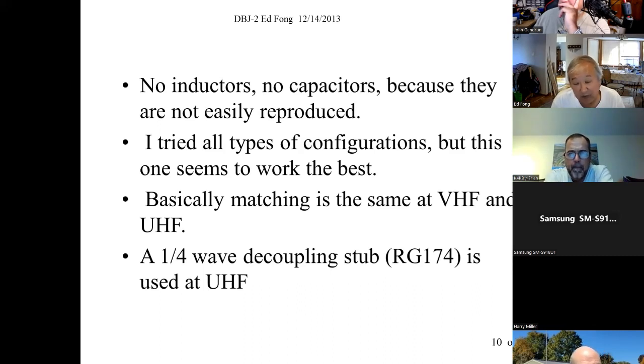It starts having a self-resonance. You start seeing series inductance, series resistance, and all this parasitic stuff. Starts creeping in at 70, 80, 90 megahertz. By 100, it might even hit its own resonance. And by 500, it's useless. You cannot predict what it is. So that means no fancy capacitors. You wouldn't be able to buy them anyway.